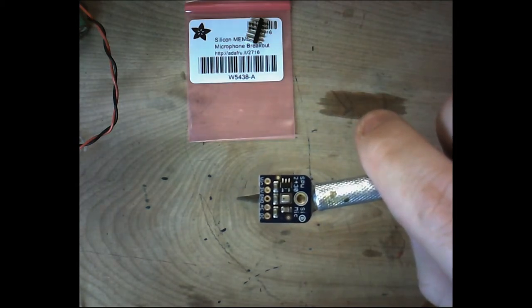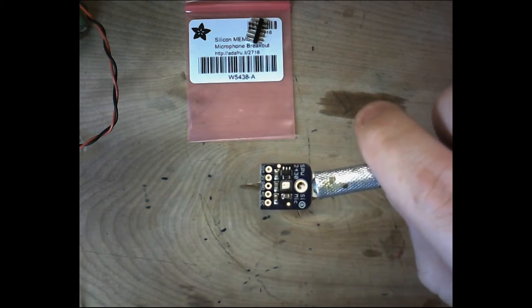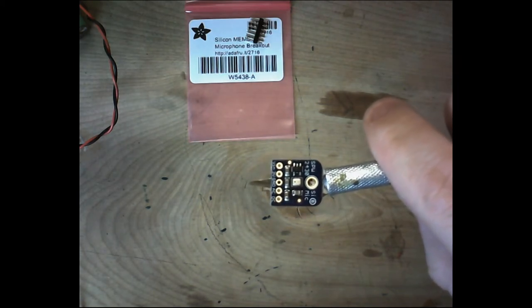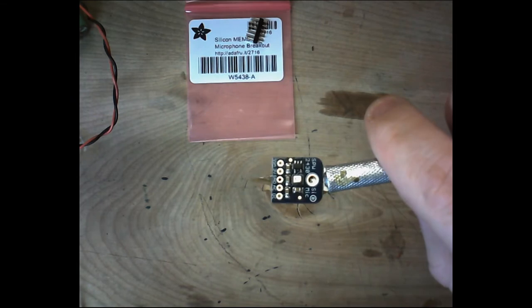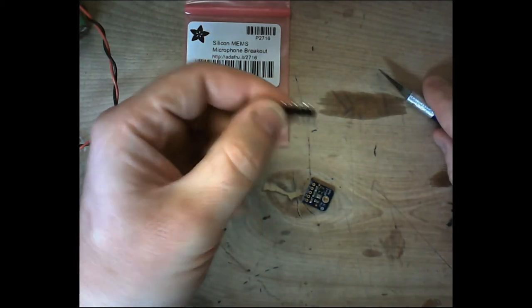We're going to use the VIN, or the voltage in, which is the very top terminal that you can see there. We're going to be using the ground, which is the middle terminal. It says GND on it. And then we're going to use the very last terminal, which says DC. If you're using this just to produce a waveform on a microcontroller, you'd use DC, and if you were using an alternating waveform, then you would use AC. But for our purposes, we're just going to be using the VIN, the ground, and the DC terminals on this. And of course, they do come with the little headers here that you can solder in there.